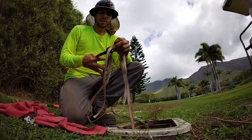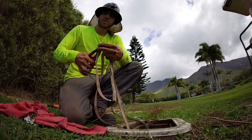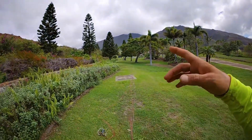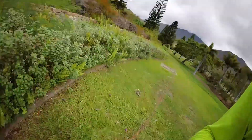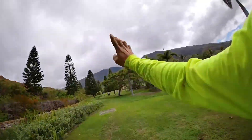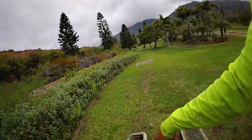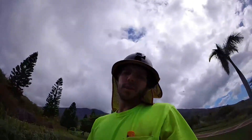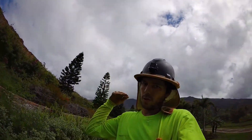I'll cut off a little bit of the excess here, maybe tape it up just for good measure. While the apprentices are helping me prep stuff, let's get our wire head prepped because we're about ready to pull this thing. To summarize: we're pulling to there from all the way across the yard, through about three hand holes, each one of which is a straight pass-through. My theory is that we can pull with our machine the whole thing straight through without having to use pull points.